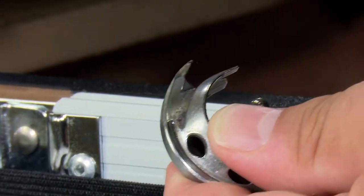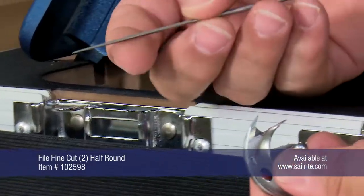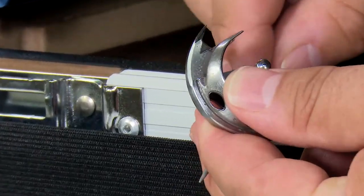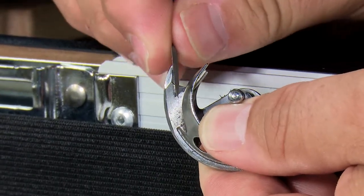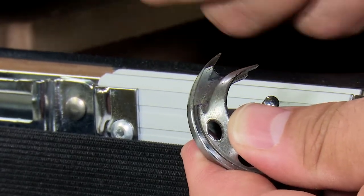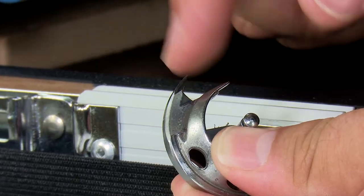Sailrite sells a fine jewelry file which is really an exceptionally sharp cutting file and works great. I recommend that everybody get one of these for their machine — they're expensive but they're well worth it. If you file like this, you can cut any burrs off quite easily. I would probably use emery paper back here instead of the file.